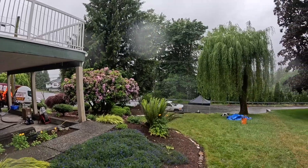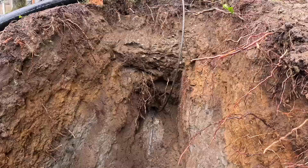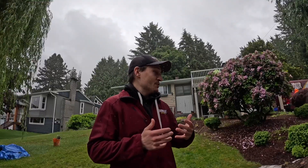The tree roots have been growing into the sewer line and they've separated the pipes at the joints. They've had multiple sections with tree roots growing in, so they keep dealing with sewer backups. They don't want to deal with it anymore. This customer has about an 80-foot sewer line, about five feet deep on average through the whole line.